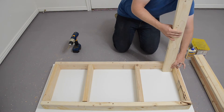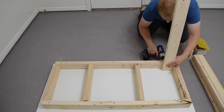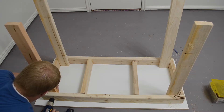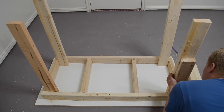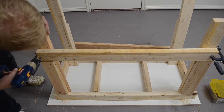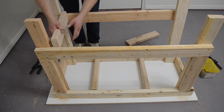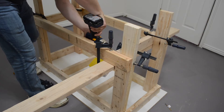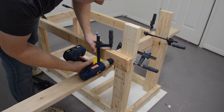Next I attach the legs — these are the 31¾-inch pieces. With casters on the bottom, this works out to be a 36-inch table height, which is about perfect for me. The 16¾-inch pieces act as doublers for the legs. The 42-inch lower supports go on next, and I found it was easier to clamp them in place before I drilled my pilot holes. I only used two 17-inch crossmembers for the lower support — I don't think you need more because the lower shelf isn't holding nearly as much weight as the upper surface. For added strength, I drove screws in both directions on these crossmembers.